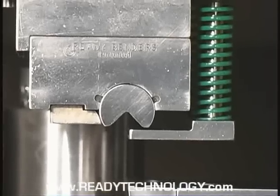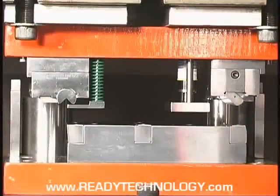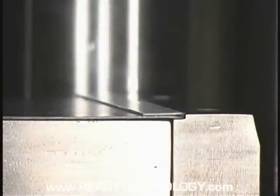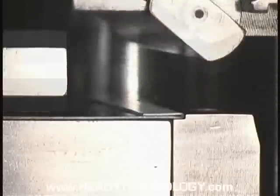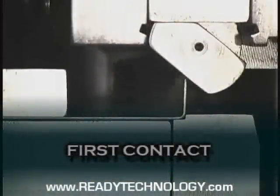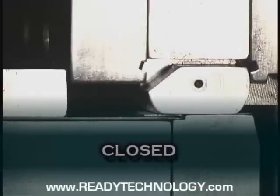What if you could reduce your tooling cost and improve your productivity by using the ReadyHemmer? Watch the hemming process using the ReadyHemmer, again in slow motion. Looking at the stages during the hemming process, the ReadyHemmer comes in contact with the open form which is at 90 degrees or slightly open. Typically, the material would be hit with a cam device from the side to create a 45, then have a bottoming tool to close the hem completely. With the hemming bender, you can take an open form with an 85 degree angle and go to 180 degrees in one step.